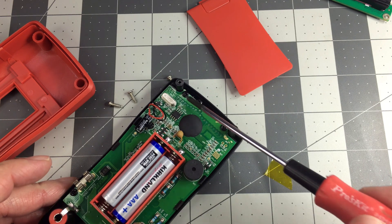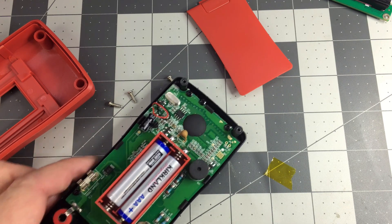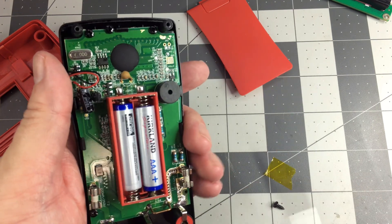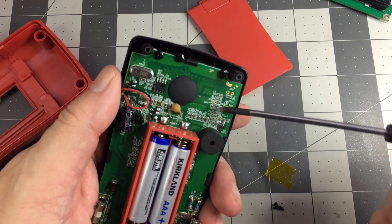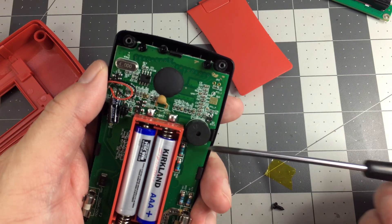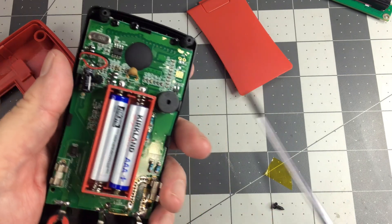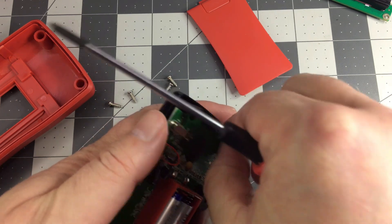So I've got one, two, three, four, five screws here, and then these clips pull off the board. My preference might have been to use a resistor, but because of the way it's mounted I don't really want to go through that kind of hassle. You'd have to cut a trace and then maybe fit a resistor on the other side of the board. Or depending on where it's getting its ground connection, you could cut it and solder in over this side. That's an option, but without pulling the speaker off to see how the traces are set up, I don't know for sure.